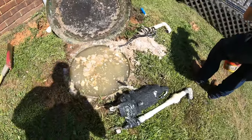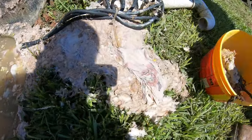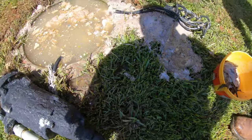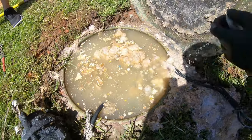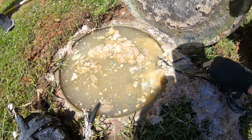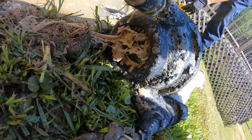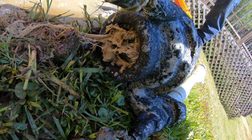One thing you don't want to do is put paper towels down in the grinder pump. And these flushable wipes that everybody says are flushable — you tell me if they're flushable, that's gross. They're gonna get caught up in this grinder, which costs a lot of money. There's the impeller that sucks it all up in there, and the impeller is jammed.